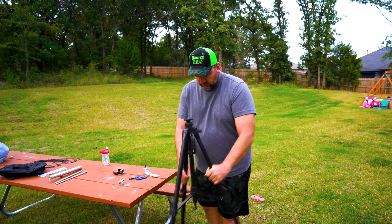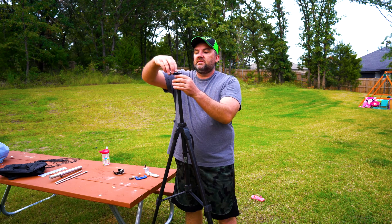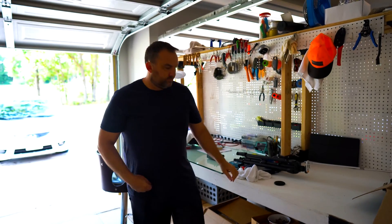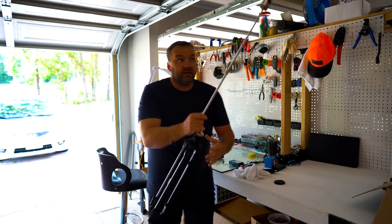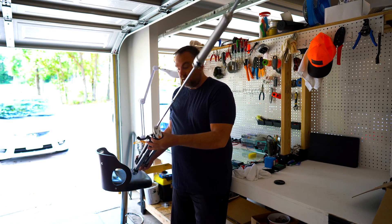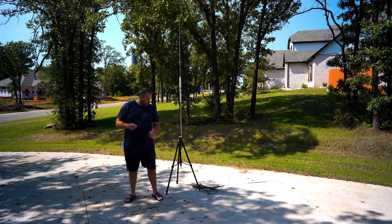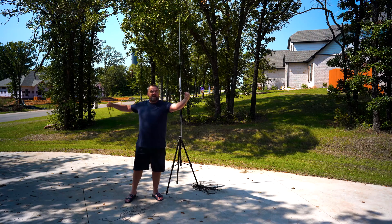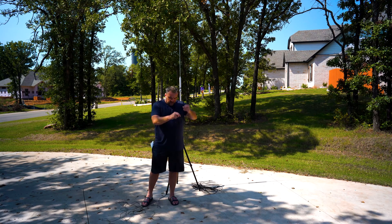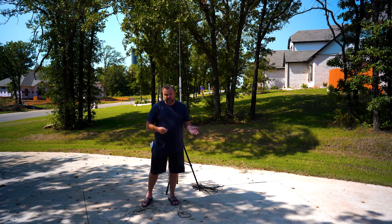So I can set this up and get it up even a little higher. I think the old mount would still work. I still have it all connected — let's set this up and see what the SWR is before we take it out in the field. I've got the counterpoise right here. I'm first going to stretch it out in a straight line and look at the SWR. Last time I did that it didn't do very well, so after that I'm going to spread out all of these radials in a fan pattern. Then I'll take the SWR again and it should be better.